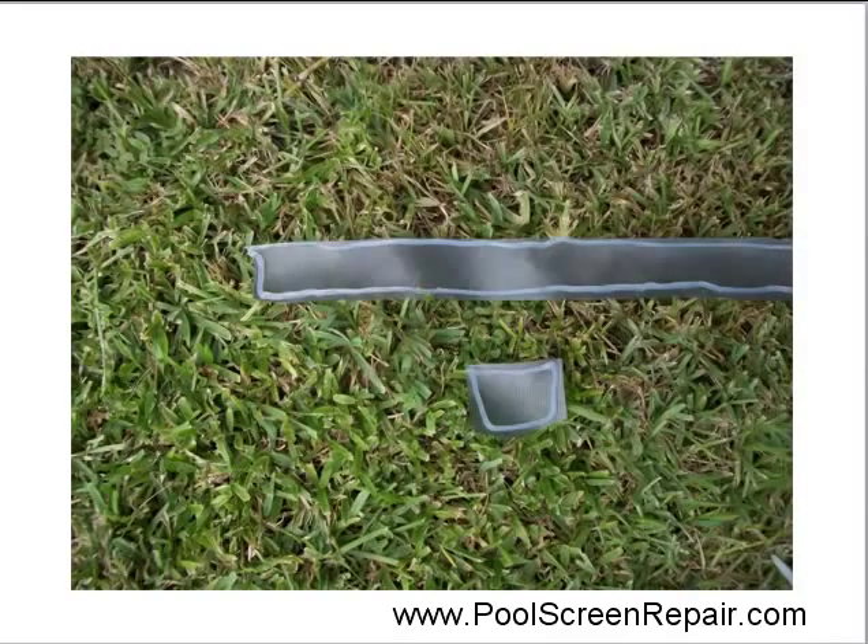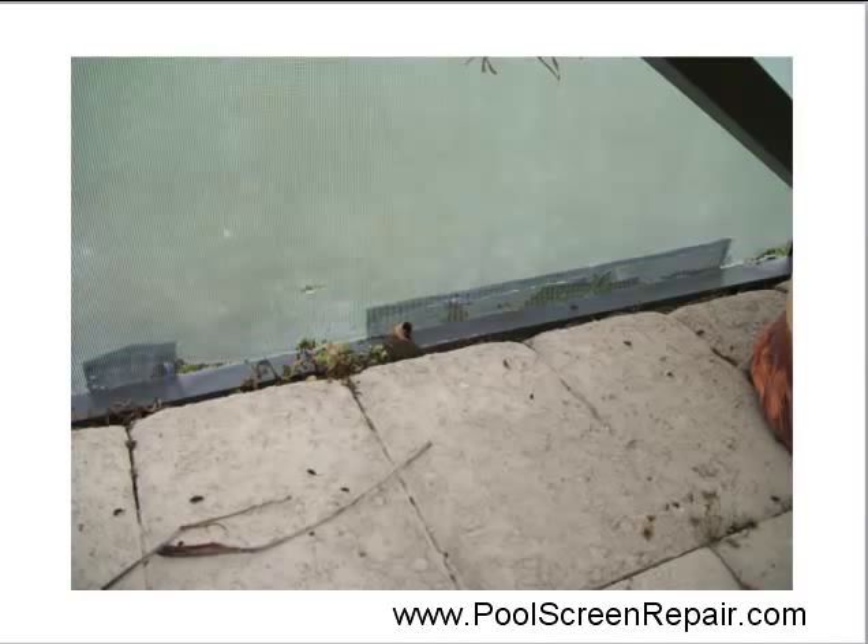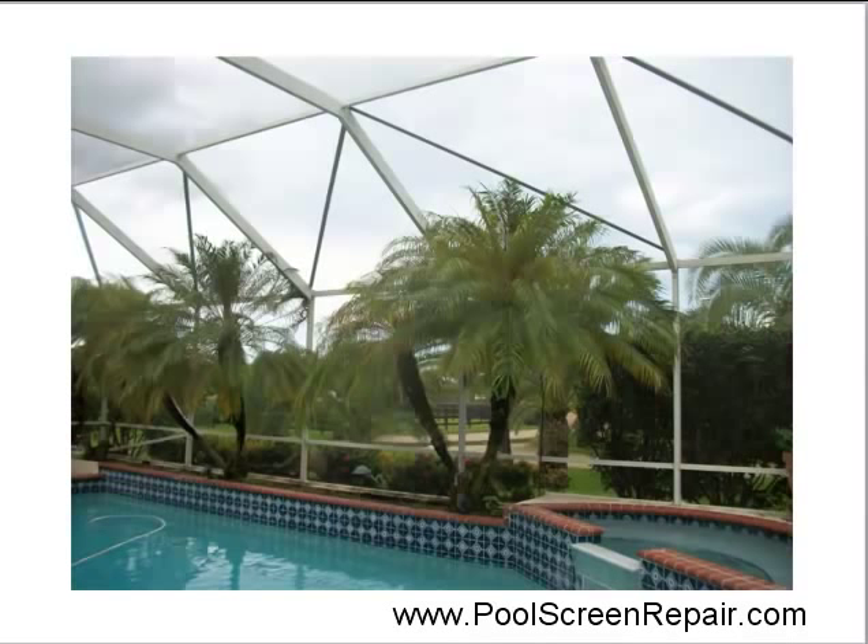Now when you get the silicone around all the edges of the little patch, you take the patch and put it over the hole. You see it's over these two holes here and you just kind of press it on there. Some of the caulking will come out around the edges — don't do that with your fingers because it's really sticky, but get some sort of paper towel or old rag or something. It'll dry — it takes a little while. It doesn't dry instantly. And so that is how easy it is to do a patch, whether it is on your screen enclosure.